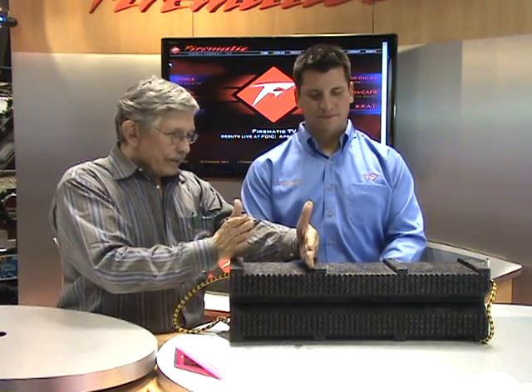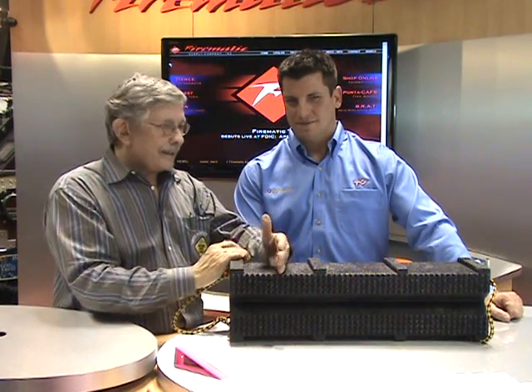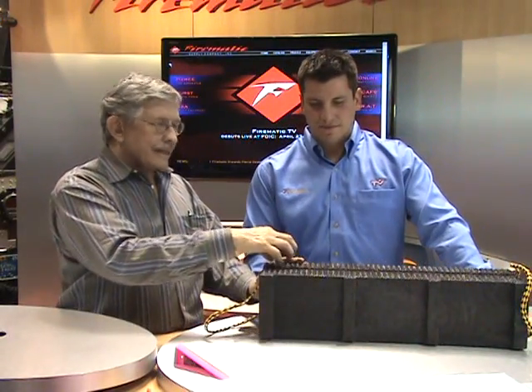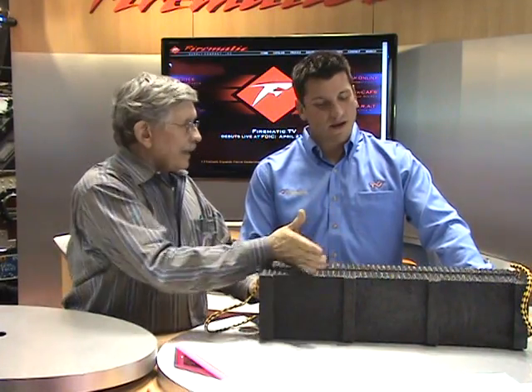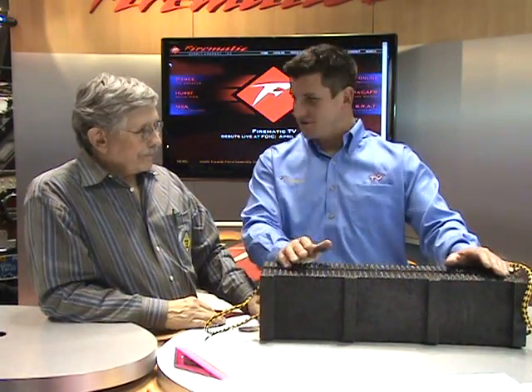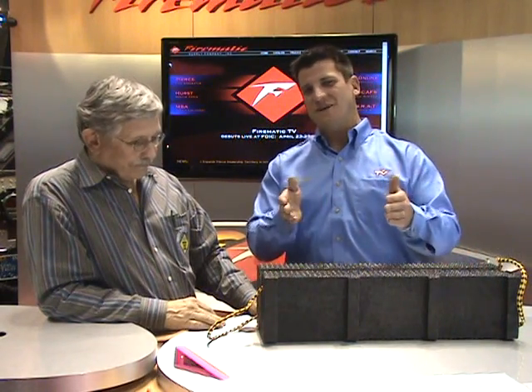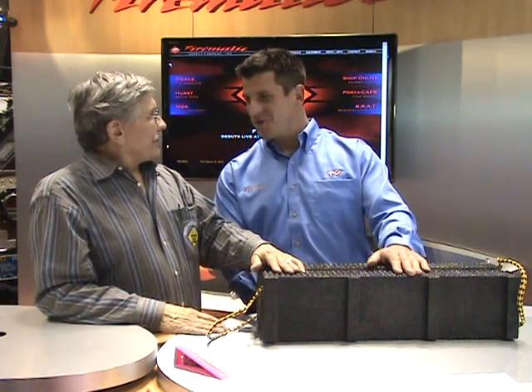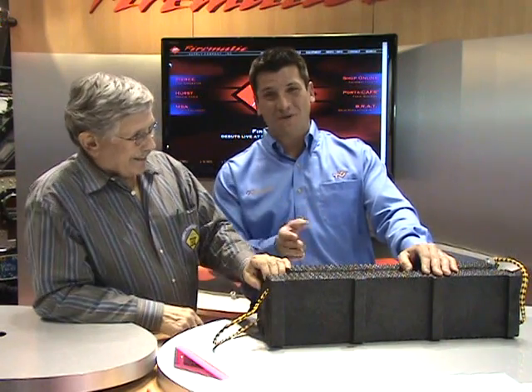It's designed to be either Lincoln Log style like this. Lincoln Log is great, but it has to be at 90 degrees. So if you can't be at 90 degrees because the car is wrapped around a pole or is halfway in the ditch, you turn it on its side and it's got a sharp pyramid right here that will lock together. These dimples — similar to that airbag retention device — are going to lock with each other and allow this not to shift. It's all about stability — it's what we're looking for when we're using cribbing in the first place. And something new: all the cribbing now has a 50-year warranty — rot, mildew, splitting, any of that stuff. You'll be out of the fire business long before this ever expires on you. That's a phenomenal warranty, Tom.